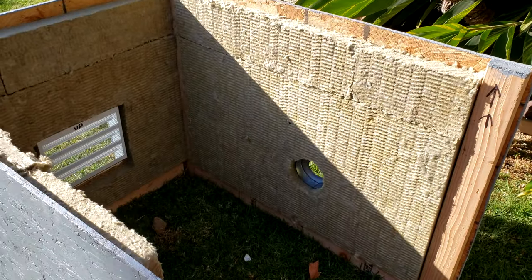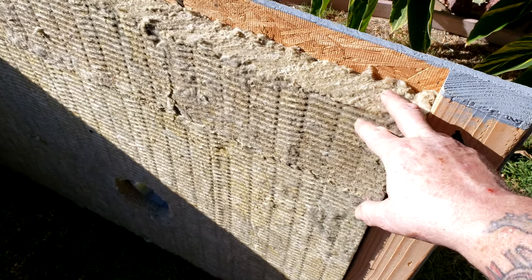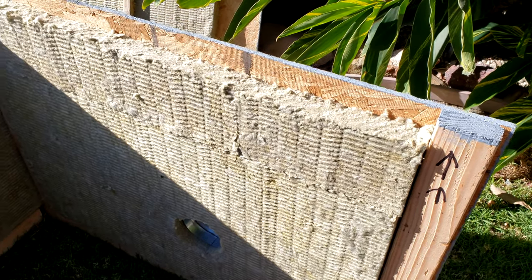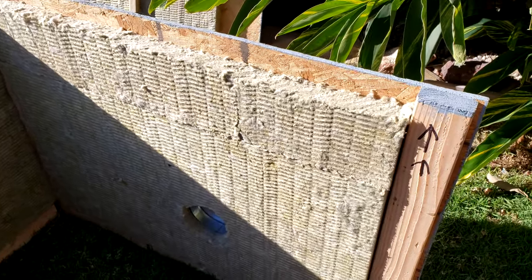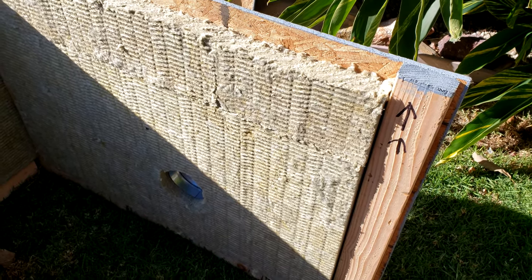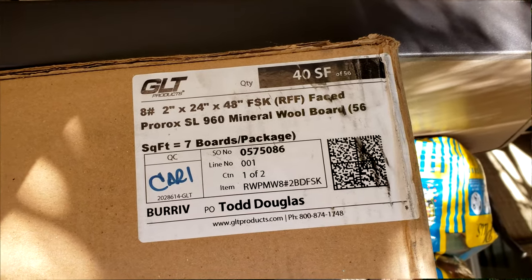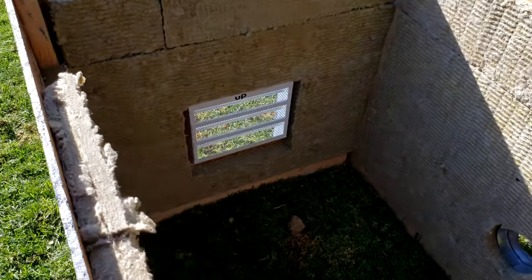Getting back to the box — the other material I'm using is rock wool, a semi-rigid two-inch thick sound-deadening insulation. This stuff goes in the walls of home theaters and high-end homes to deaden sound. They also sell it in 16-inch wide batts or rolls, similar to traditional insulation, but this is the stuff I had to mail order. I'll leave a picture of the tag. One consideration: you've got to have an air inlet on one side because the generator can get warm and it's going to need air.